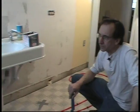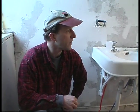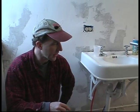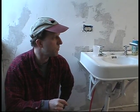The Gypcrete doesn't normally crack, like concrete can be expected to crack. It's the nature of the product. Right. And gypsum cements are normally shrinkage crack resistant. Mm-hmm. But it does crack if the floor moves. Mm-hmm. We have a room that's small enough here that I don't anticipate that you'll have too many issues there. I threw some extra wood underneath it too.